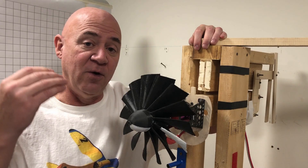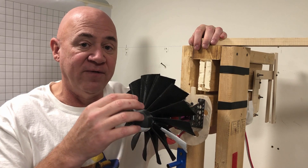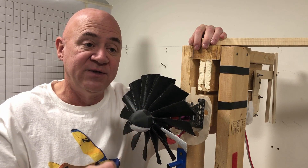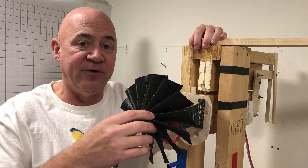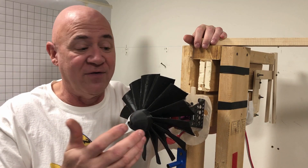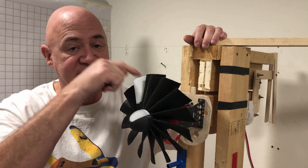I'm going to start on 8S and go through increasing RPM levels. If I have to go to 10S to get it to disintegrate, I will. I'm hoping to run this continuously for about an hour — changing batteries as needed — at around 6,000 RPM without it disintegrating. I have six test plans where I incrementally increase the RPM. I know there are people who say it'll blow up over 3,000 RPM — it might blow up at 2,500 — but we'll see. The motor is a Hacker A60-16L, my standard test motor.